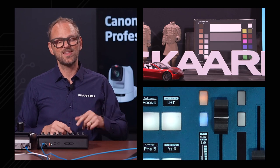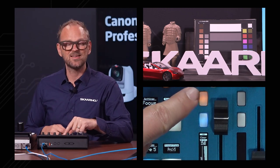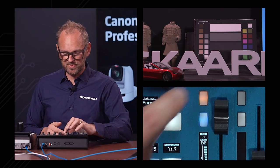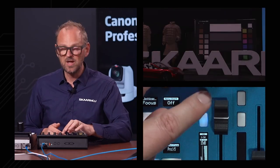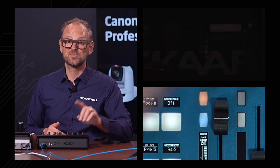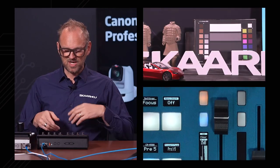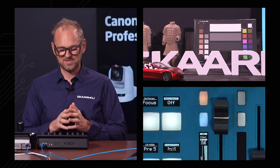Let's bring some light into the camera and gain it up a little bit, because we could have fun with the ND filter. The upper button up here is going to give us ND filter — this is 1/4th, then we have 1/16th, and then 1/64. So those ND filters, motorized as they are in this camera, are now changed around from these buttons over here.